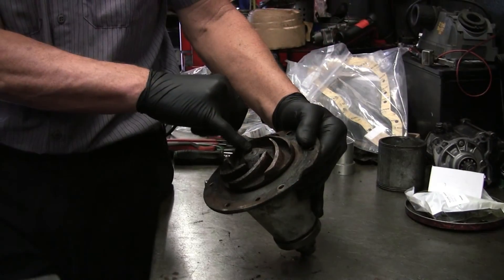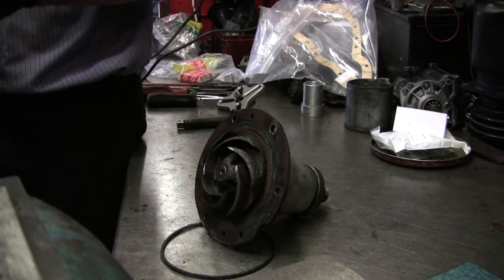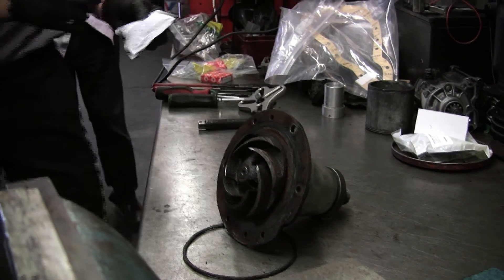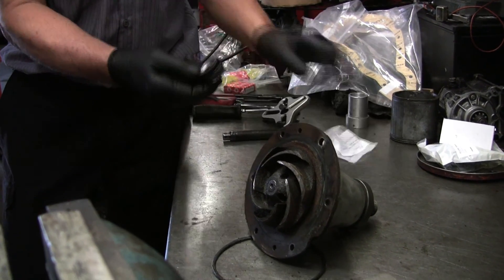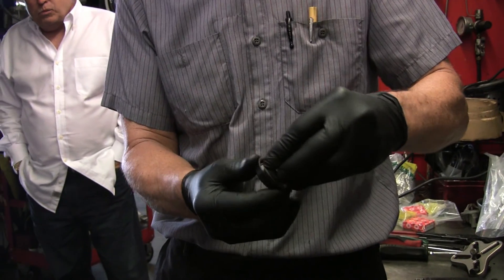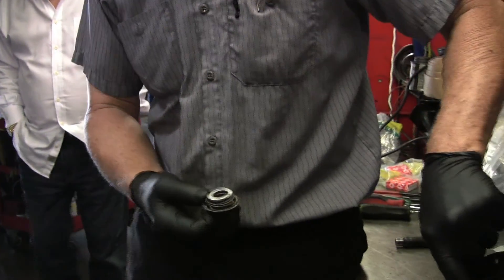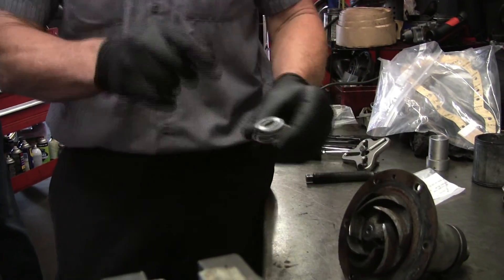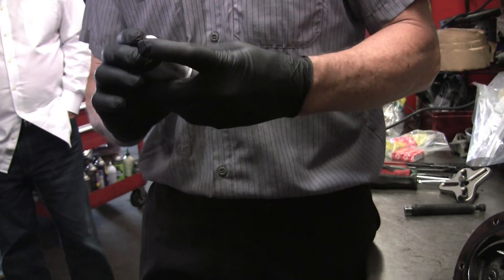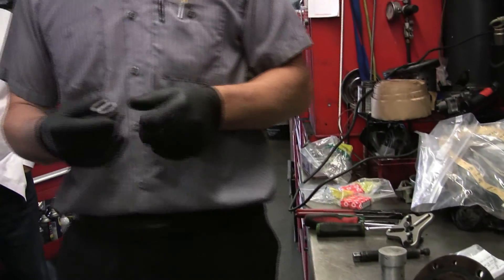There's some corrosion on this. Someone has taken a punch and punched the shaft here, which kind of mushrooms out to keep the impeller from falling off. The tricky part is pulling this impeller — you have to pull it to get to the seal you have to pry out, to get to the snap ring, to get the main shaft out so you can get to the two bearings. This is almost like a washing machine seal — the inner part has a carbon surface that turns and is spring-loaded. This piece has to press over this shaft tightly, so if you try to just hammer it in like most seals, you will ruin it. You have to use a special pressing tool that presses the inner and outer parts at the same time without letting it pop apart.